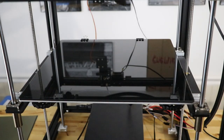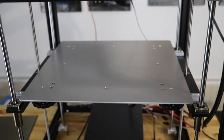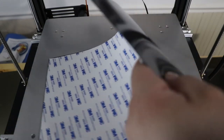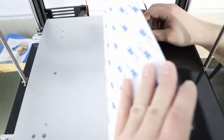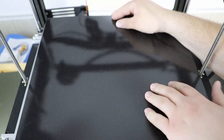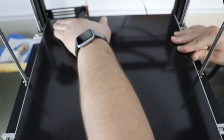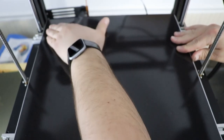What you want to do is take all your clips off the bed, take your glass plate off, and that leaves you with just the bare aluminum build plate. Then take your magnet from TH3D, peel back the paper just the corner, and flip it around. Make sure your paper is folded backwards and everything lines up around the sides. When you're confident everything lines up, push that corner down. It is a little bit forgiving, so push that corner down and work it in so it's nice and sticky all the way out to that corner.